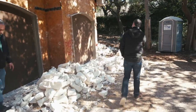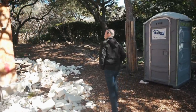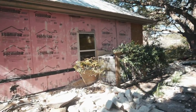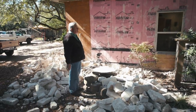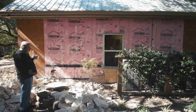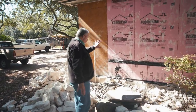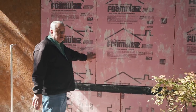Let's walk around this side and see what else we can see. The first thing that's interesting to note is we've got all the solid sheathing here, but in the gable you can see they switched to a foam board sheathing. There's this concept of putting shear panels in the corner to handle the shear of the building, then infilling with rigid insulation - it's non-structural but gives a little R-value. One of the really interesting things about this area is that they chose to flash the horizontal joints but didn't flash the verticals.